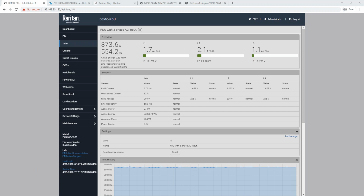and it's really dependent on how you are loading your racks. Obviously 30% is too much, but on this PDU, there's not much of a load on it, so you can't really avoid it in that case. Now, if you are closer to capacity, that 5 and 10% value is going to be a lot more realistic. That's why we plug those default values in, because we're expecting this PDU to be utilized fully. So those are good guidelines, but you really have to go off the historical data that you have in your data center, for how you manage it.